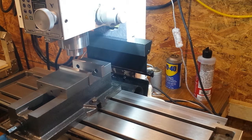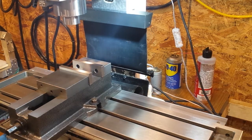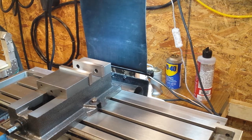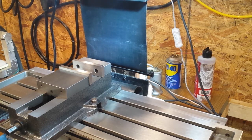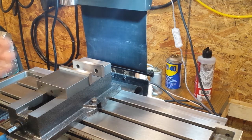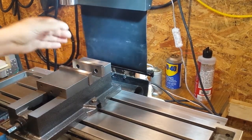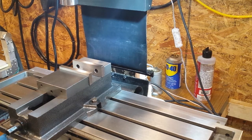The nice part of this is that when the Z axis moves up, it pays out the material as necessary and forms a nice thin barrier preventing chips or any oil or anything from getting into the ball screw or onto the ways themselves — and it will collect it. You can see if I pull on this how it has a nice springy behavior; that's the spring inside the rolling shade taking effect.